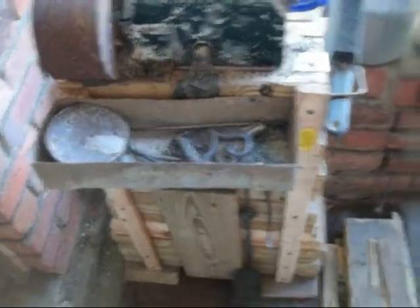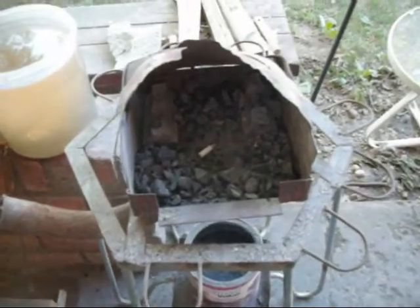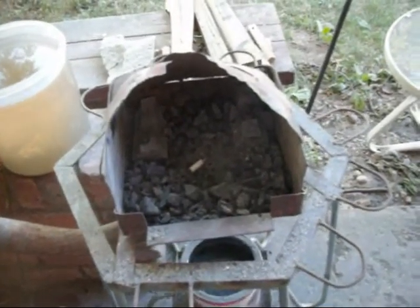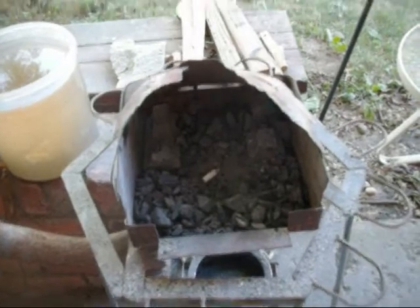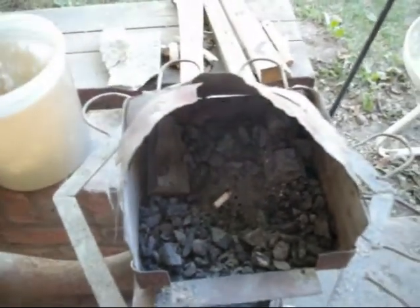I've got a little tray on the side, and I've also beefed up my forge a good bit. Built a square pan out of 1/8-inch sheet metal. It's 4 inches high on the side, 2 inches high on the front, and I just sort of got a rough little shroud in there to keep the sparks down a bit.